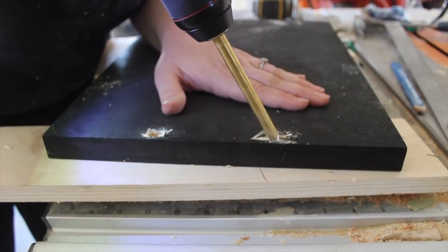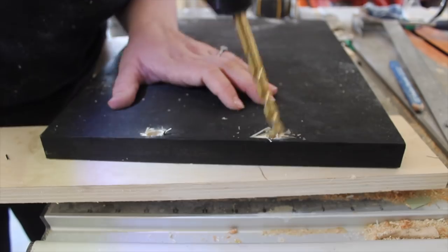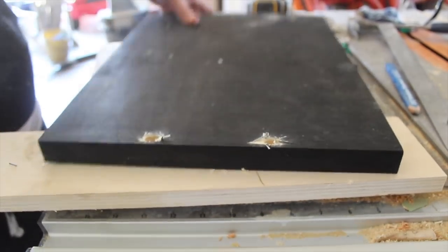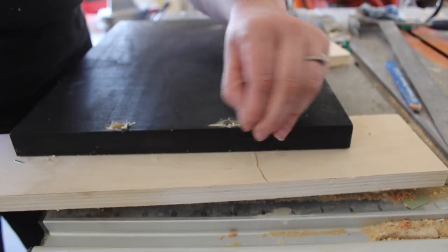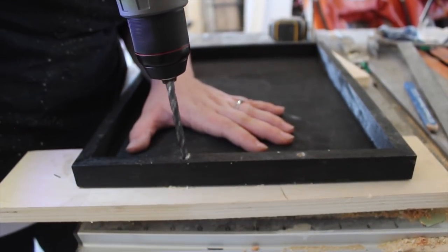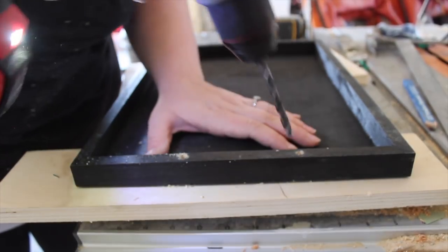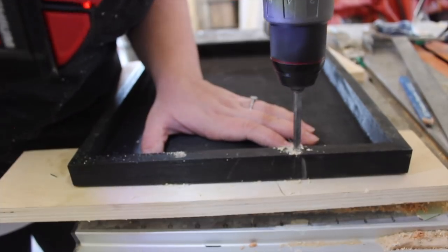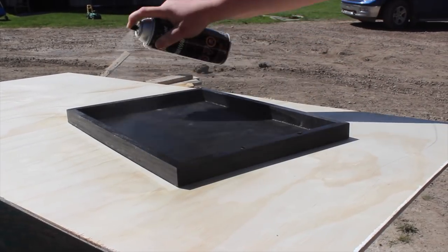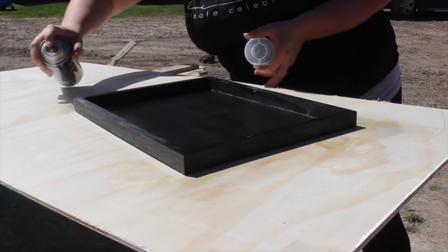You can see that I had some little bits of wood splinter off — that's totally fine. When you're done you can sand it down a little bit and use your stain again to touch up any of the exposed wood color. Then do the same thing on the other side of the tray so that you have two slightly larger holes on the bottom and two holes on the top. Since this was going to be an outdoor tray I also wanted to protect it, so I sprayed it with a clear finish coat before I put the handles on.